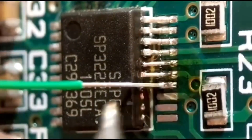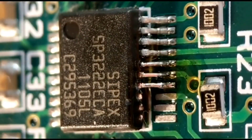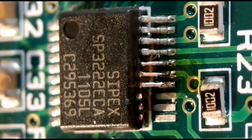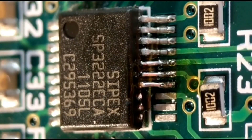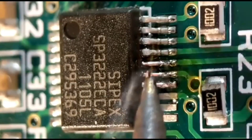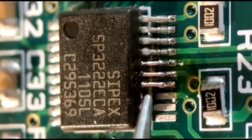Adding the third wire link — same again, put it onto the pad. Get your scalpel blade and push it up against that. I scratched back a little bit of body earlier to expose some copper. Just join them on the top, then I'll clean them all up. You don't need much solder here — just put a little bit on the top, got to be pretty quick. There you go — you've got three nice joins, all nicely soldered down the bottom and three nice joins up the top.